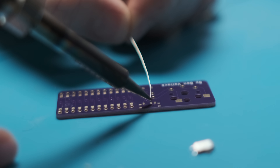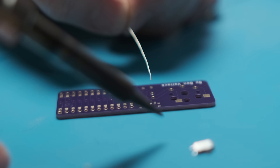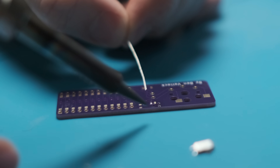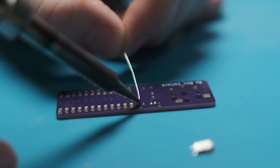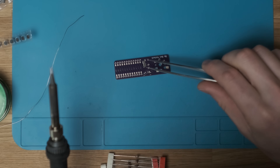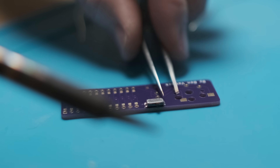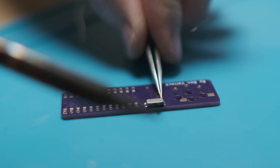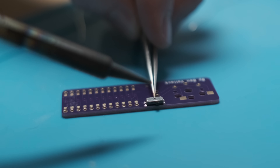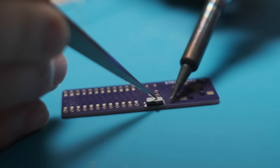We're going to jump straight in with the slider switch on the board, because this is the thing that's the most fiddly and most prone to fail, so I like to get this done first. I'm just touching the pads, putting a bit of solder on those pads — not doing the one that isn't used at the back, just the two connected ones. Then we grab this tiny little slider switch and place it so that the pegs are lined up with the holes, apply downward pressure with the tweezers, and add heat with the tip of the soldering iron on the feet so it sinks into the pad.